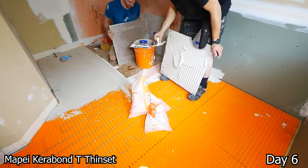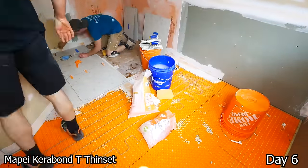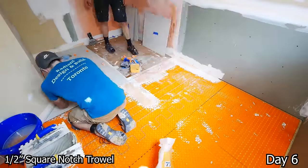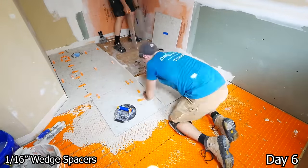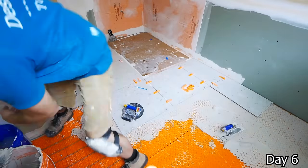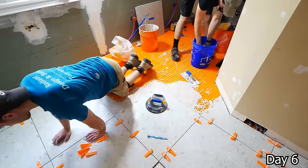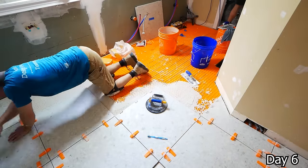When it comes to tiling, I'm choosing to do my floor here, and that is because it is a curbless shower with a smaller tile in the shower pan itself. In this bathroom, we're doing a river stone, so by finishing the shower floor, I get those nice straight edges established, and that way, when it comes time to tiling the floor, it becomes really, really easy. In fact, I didn't have to make a single cut in the shower pan as it is just a river stone, so we're able to just lay it all down nice and neat.